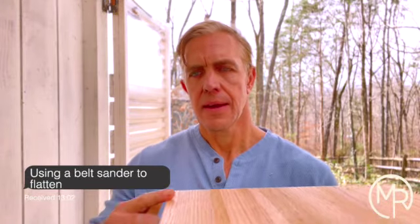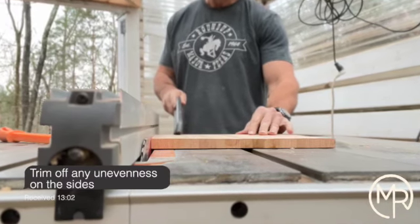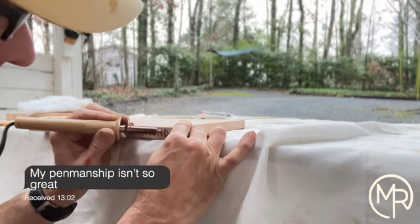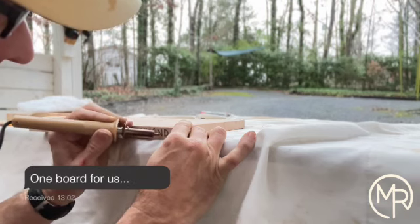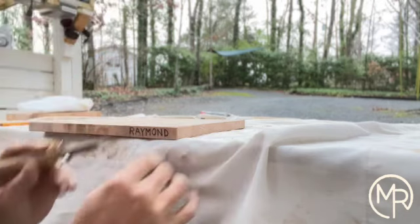You have to keep in mind that depending on the glue-up and the precision level of the previous pieces — if there's perhaps up to a quarter inch off in height in any one of these in either direction — you kind of have to double that, and you might potentially lose in that case like a half inch of thickness just from the planing. So that's something to keep in mind.